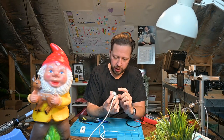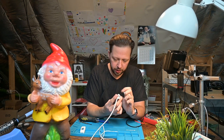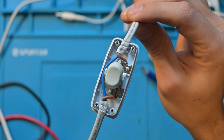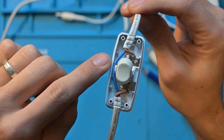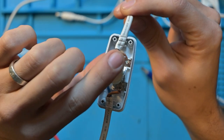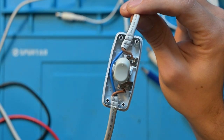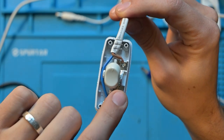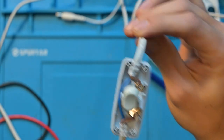So they're running a wire and one of the two wires here is disconnected. We can definitely work with that. As you can see, one wire goes in and all the way through — that's the blue one. And then one wire gets disconnected or turned on and off with the switch. So what we're going to do is we're going to cut this wire, the blue one, and desolder the brown one, which will allow us to put in our new connector.